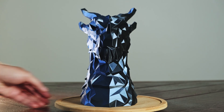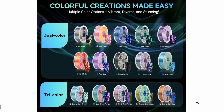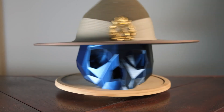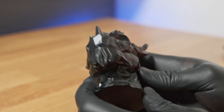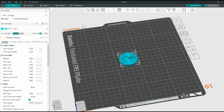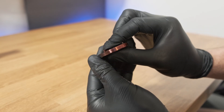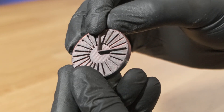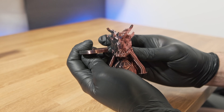You may have noticed my silk dragons are two different colors — this effect comes from using bi or tri-colored filament, which looks really awesome. You can get color-shifting effects straight off the printer with no post-processing required. But every spool is wound differently, so for repeatable symmetrical models you'll need to test how the color pattern wraps for each spool. Print a configuration disk — it only takes around 20 minutes — where each notch represents 15 degrees. Find where you'd like the color to transition, note the angle (on mine it was about 105°), then rotate your model that amount before printing so the colors transition exactly where you want them.